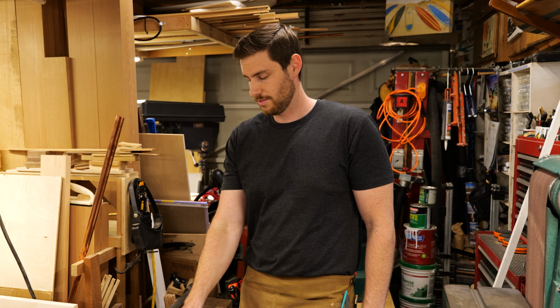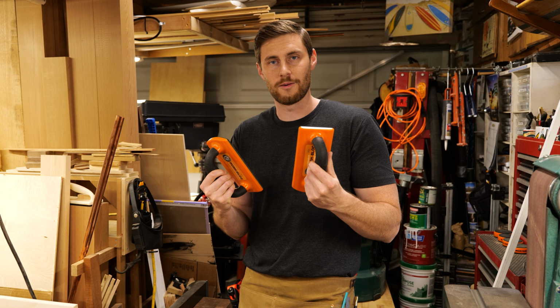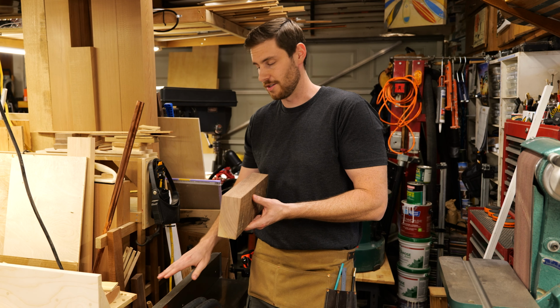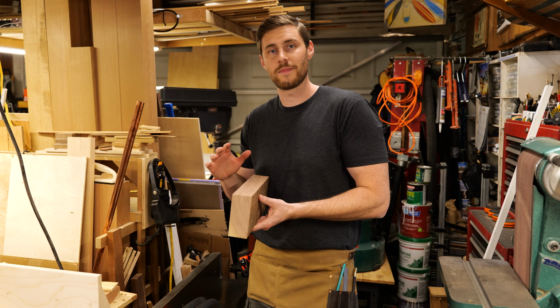Now, something to keep in mind, you always want to have these available. I have a push block or a push stick. Now with a jointer, usually you're looking at about a 1/16 to a 1/32 of thickness being removed. I like to sit around 1/32. Now with edge jointing on the jointer, you want to make sure that any pieces that are shorter than the fence height, you use a push stick to keep your fingers up and away from the blade.